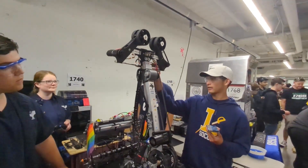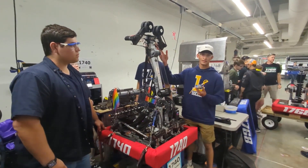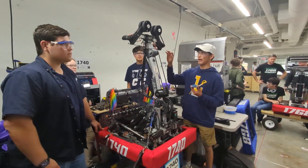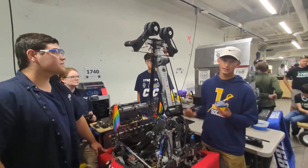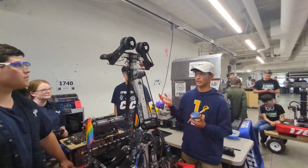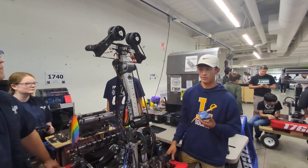Our rack is 3D printed, and so is the pinion. For the claw, we printed it out of tough PLA and added some angled cuts into the model so that we could have the claw set at two positions — one to intake cubes and one to intake cones. We went with wheels so that we could play with more of a touch-it, own-it game strategy when picking up.